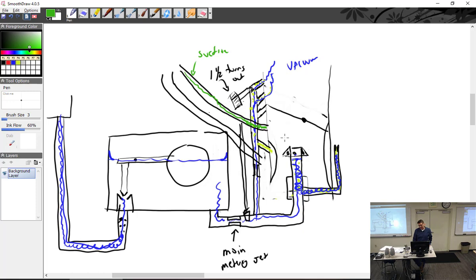Why is it suction? Well, because it's over here, just above the Venturi. And then we've got another one, which we'll color red because that's what I got, which is behind the Venturi, which is ambient. So it's not pressure, it's just ambient pressure, not any sort of extra pressure. And it runs up to, and I'm not going to be able to draw this very well, kind of a mixing valve, if you will. So we'll just put a square right there. And then out of that mixing valve, it comes out and goes into the float chamber. Hopefully you follow me so far.